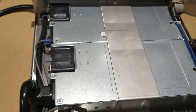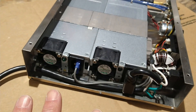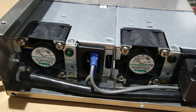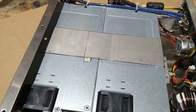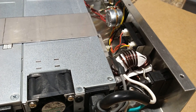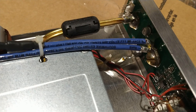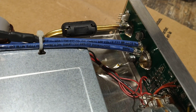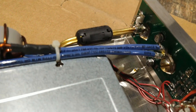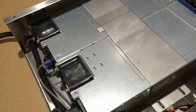What he's using here is two computer power supplies. Most of these things can only go up to 12 volts, but they're modified so they can produce higher voltage — up to about 14 or 14.5 volts. It's all packaged in here real nice. I don't know exactly how he's got them set up — if one's a slave and the other is the main one. You can see the chokes he's got in there for the RFI, and there's your positive and negative going there.